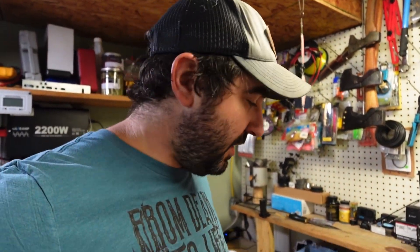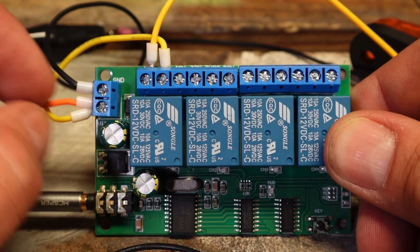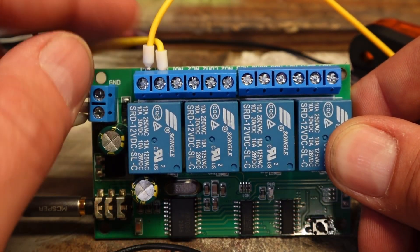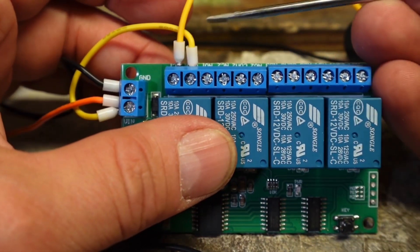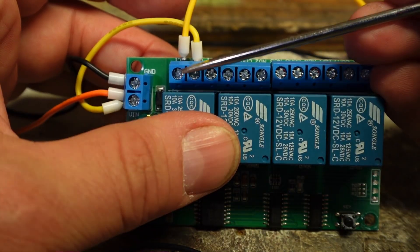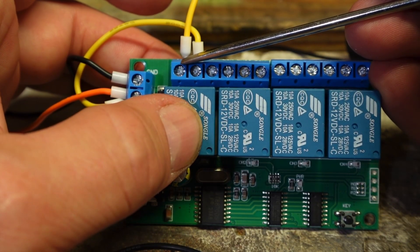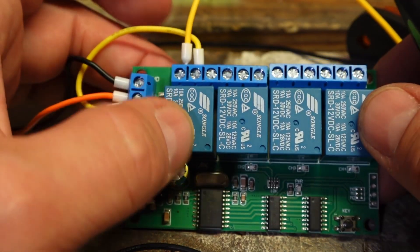Now we've got you on the small camera — let's go down and look at this board. Your power is coming in over here. This is your hot and this would be your ground. Normally you would have this common wire run into a fused link, and then we have a normally closed over here and a normally open over here. We're going to be using the normally closed because we want this thing to constantly power something. When power fails and comes back on, we want it to power the unit back up.